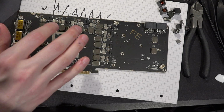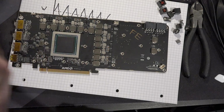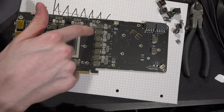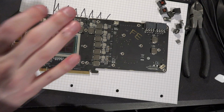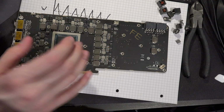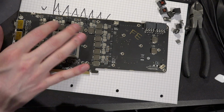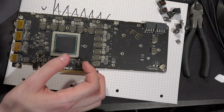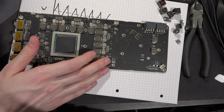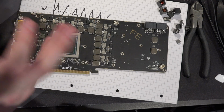And so if you were going to be trying to dampen it with high temperature silicone, or hot glue that melts at a temperature higher than the VRM runs at, keep in mind, VRMs can run at 110 degrees, and it's perfectly safe for the MOSFETs. Now, certain types of inductors will actually degrade over time if you run them really, really hot, but it takes a while for that to happen. Ultimately, on a lot of reference cards, like an R9 290X reference, which those are notorious for coil whine, the stock VRM there runs like 90 to 110 degrees.